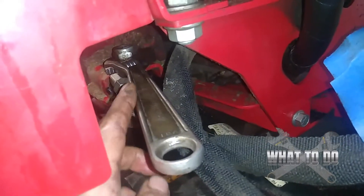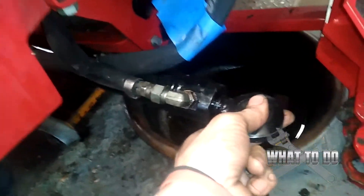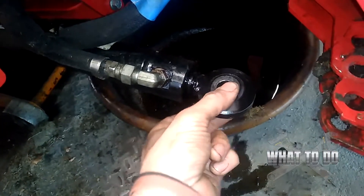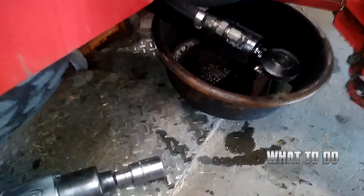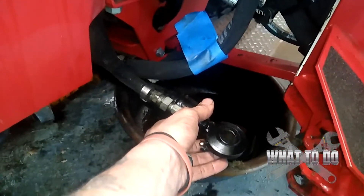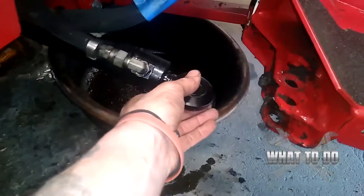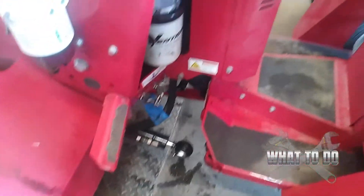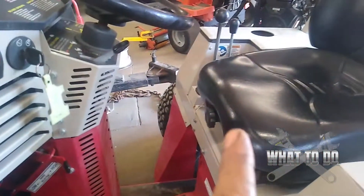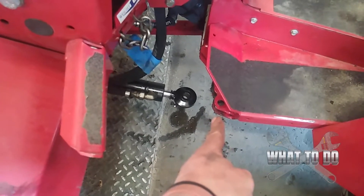It lined up fairly easily. I got an adjustable on the top nut and I'm putting my air gun on the bottom to tighten it up — she's tightened up. Now you have the pivot greased in there and this will pivot up and down. We're going to clean up all this mess, take it down off the jack since I no longer need to get under here, start up the machine, and let the hydraulics push this out to where we need it. We're going to sit on the machine, start it up, and as you turn the steering wheel that cylinder will retract out and we'll be able to line it up.